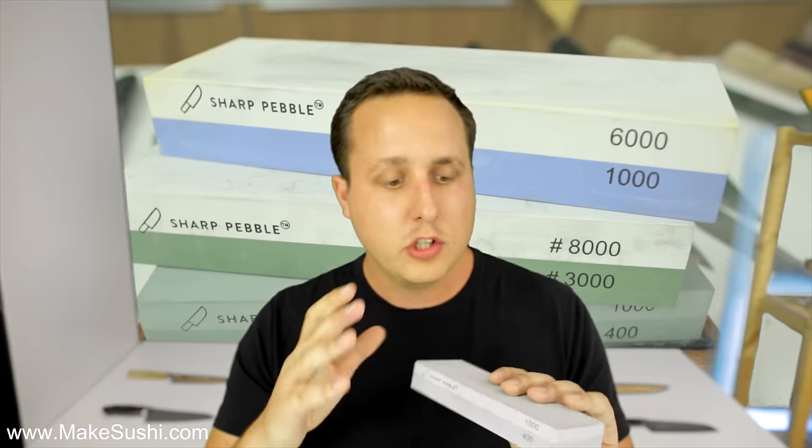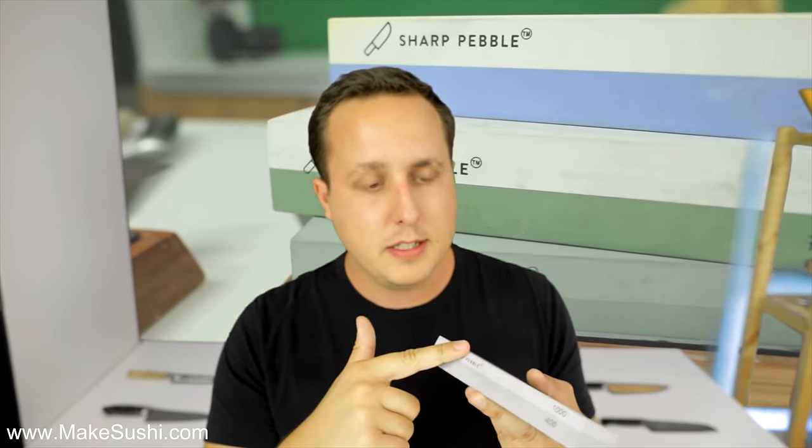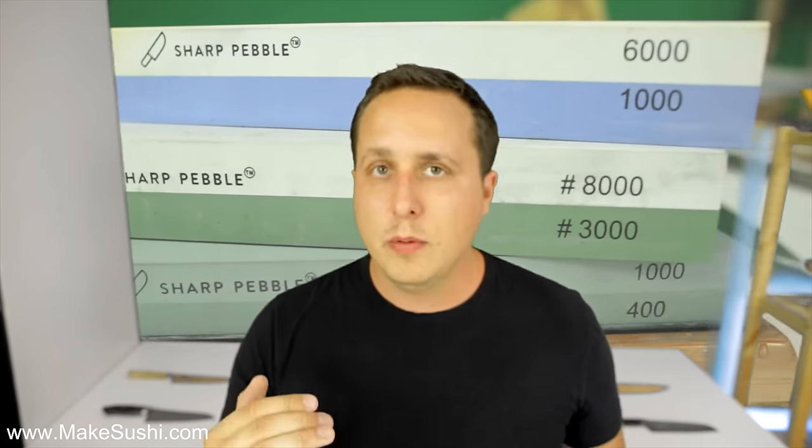The method I'm going to show you today is going to use wet stones and a leather strop system. The wet stones are your basic standard sharpening system — these are stones made by compressing particles together and gluing them, and they have what is known as the grit system. This stone is number 400 on one side and 1000 on the other. The lower the number, the bigger the particles; the higher the number, the smaller the particles. Big particles remove more metal, which is good for removing chips. Higher numbers give a more polished, smoother surface. You can get stones that go all the way up to 30,000, but realistically you just need somewhere between 400 to 8,000 with a couple in between.